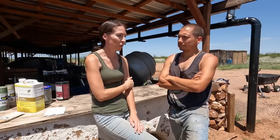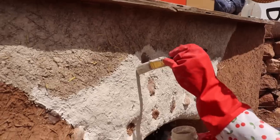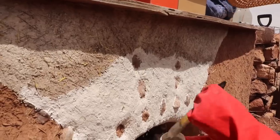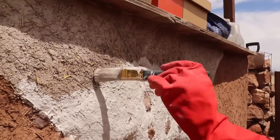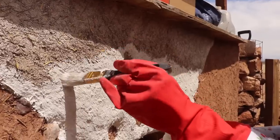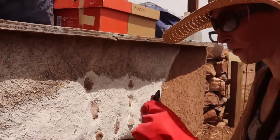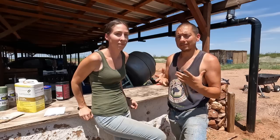We'll probably be using more sand for the rest of our dome. Using sand versus eggshells should make it stronger, so that's even less to worry about. We should also do a lime wash over the plaster — with the natural hydraulic lime and sand it's going to take on more of the color of the sand, so it'll have a gray color rather than white. Going over it with a lime wash will brighten it up and might add even more temperature and weather protection. It's just another layer any weather has to get through, and it's a lot easier to paint on lime wash than to apply a whole other layer of plaster. We'll leave our particular mix in the description below for reference.